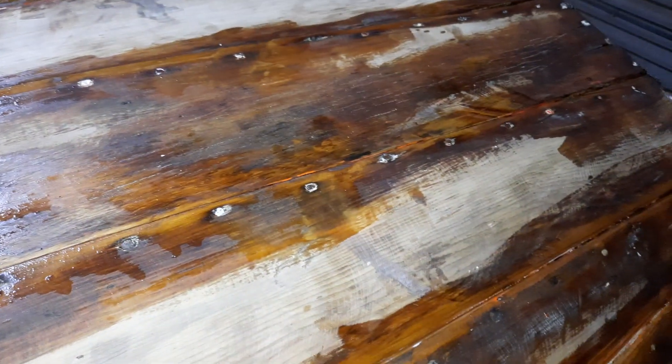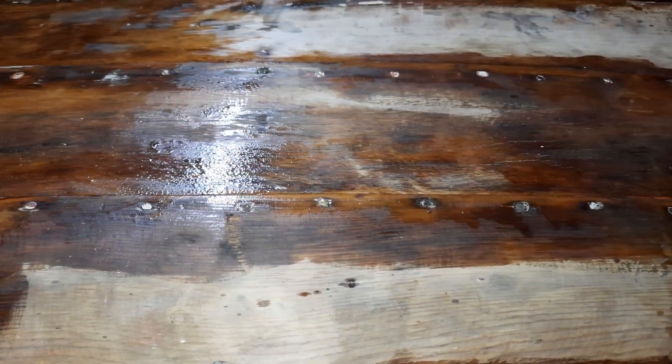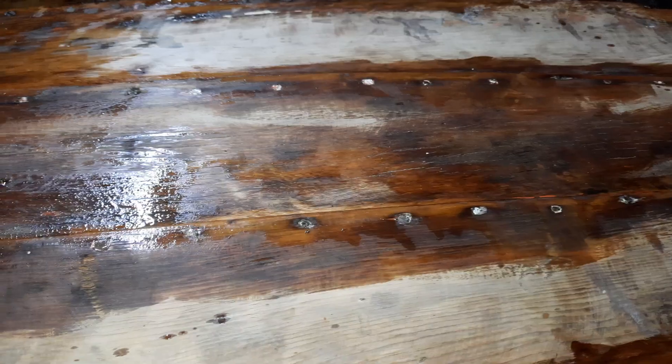You've also gone over all those big splits and filled places. Up here where there are very fine cracks starting to appear in the timber, rub the epoxy right into that. It should not only seal it but also prevent it from continuing to split — it should bond it all together.